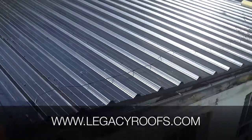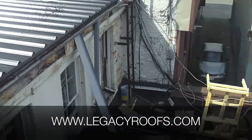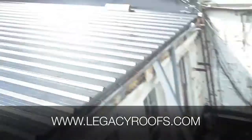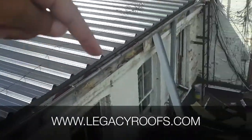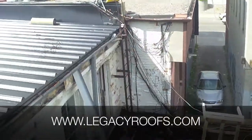We still need to install a downspout on this east trough. At the end we're going to bring it down into the alleyway, just to eliminate water ponding on this roof. All the water from this roof will collect onto this roof, hit this east trough, run down here, and then we want to put a downspout down into that alleyway. Okay, we're on day three of the project.